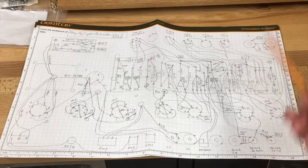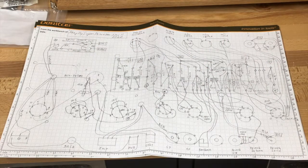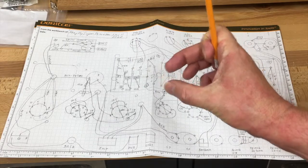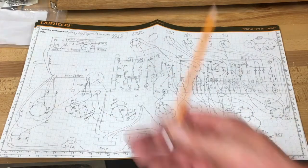When you look at the wiring diagram I've designed for this amplifier, a few other things become apparent. The first is that I'm using something called a Humdinger. This goes into the heater wiring and it allows me to control the balance between the two heater lines. Normally you would just use a 100 ohm resistor to ground on each leg. This gives me the ability to just tweak it just right, in case there are any discrepancies in the windings inside the power transformer itself.